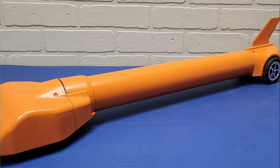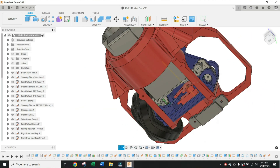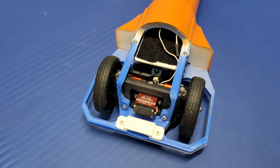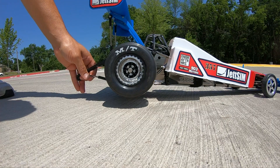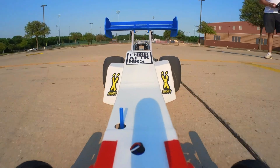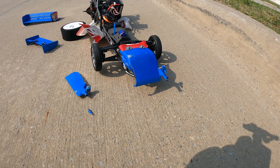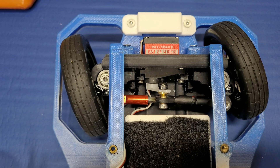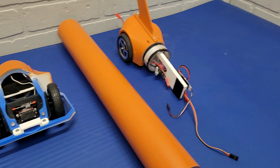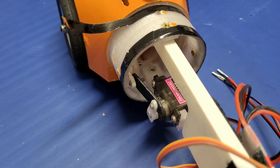I also had to make an entire RC car to go along with these rockets. We started in the digital world, like always, and then quickly moved on to both resin and FDM 3D printing. I'm using the front wheels from a Traxxas funny car dragster. That car had a ton of downforce but was incredibly unstable under braking. These parts are crash tested at over a hundred miles an hour. The steering and front end packaging is incredibly tight even with all the compact electronics, so I had to throw the igniter switches and other electronics in the rear section because we were completely out of room.